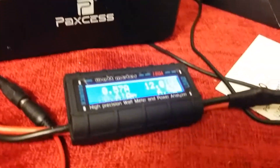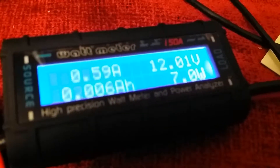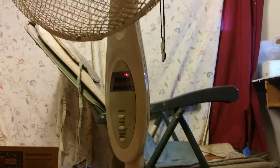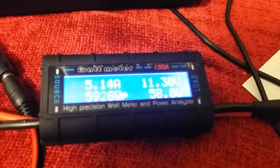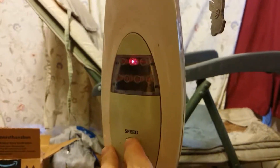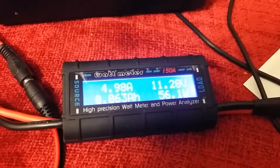Running on DC output, I have a 110 volt oscillating floor fan plugged in. At idle with it just plugged in it pulls up to about 7 watts, or 0.6 amps at 12.01 volts. On the lowest setting it's drawing 55 to 58 watts consistently.